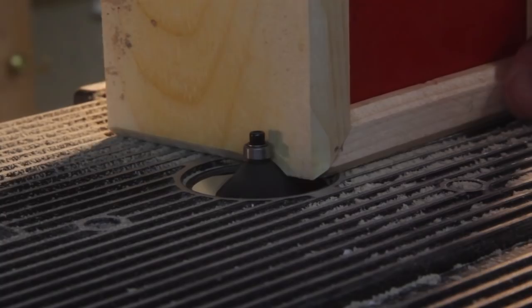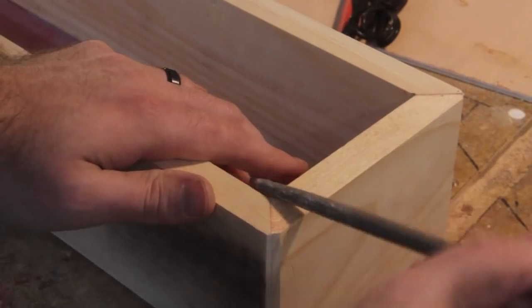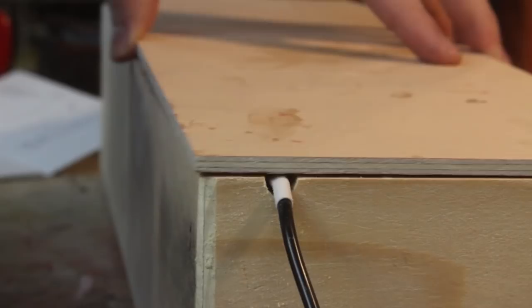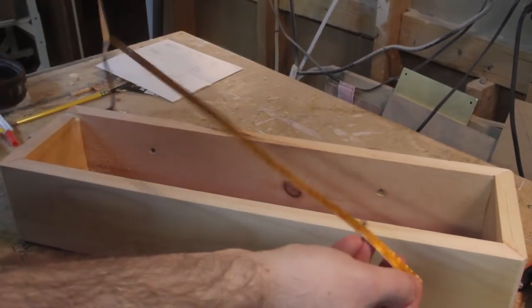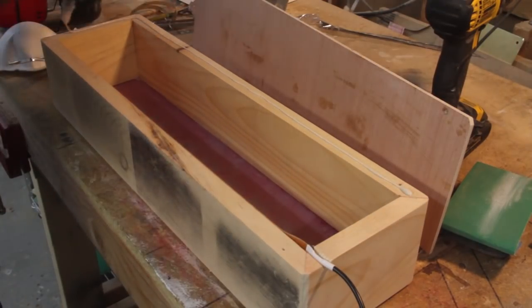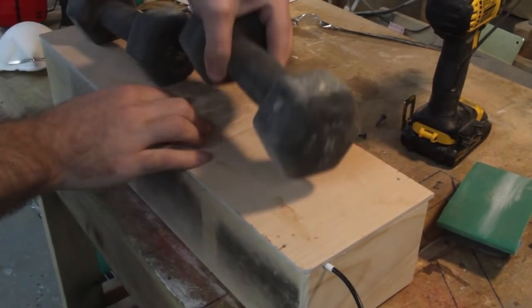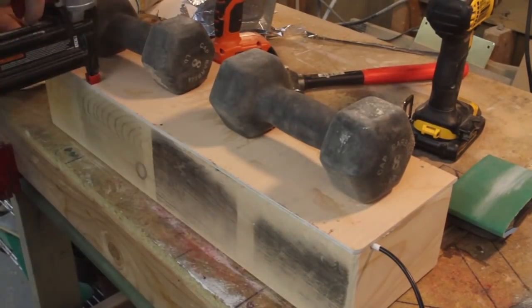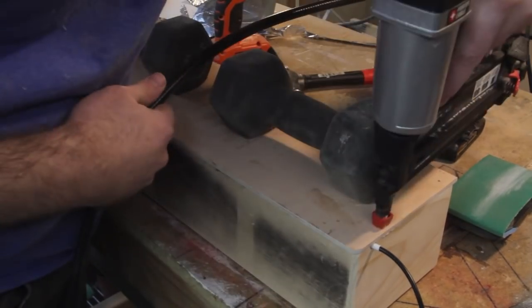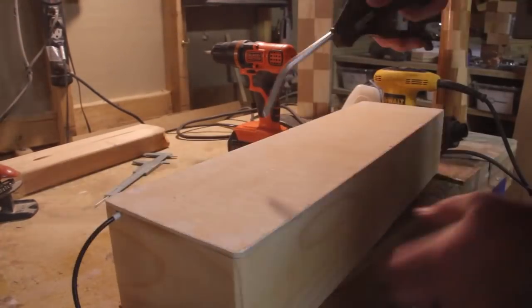Once that's done I'll hit the sides with the same router as before and smooth everything out by hand with 200-grit sandpaper. Next I'll start filing down a channel for the wire to run outside of the box — since I used pine this doesn't take long. For the light I'm using a 20-inch USB-powered LED light strip; I'll have a link in the description. Once I stick the LED strip to the bottom back part of the box, I can adhere the panel with wood glue and a few brad nails. The leftover corners can be sanded by hand. Then I'll thoroughly clean off all the dust and prep it for paint by masking the letters.